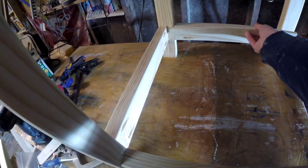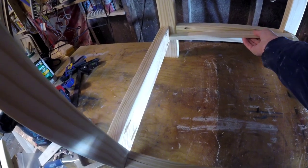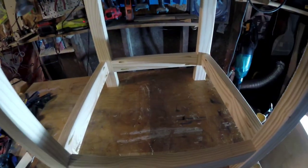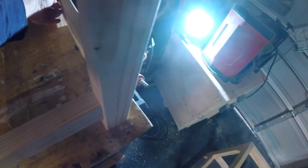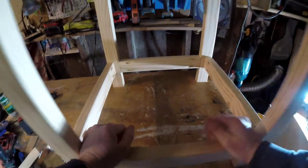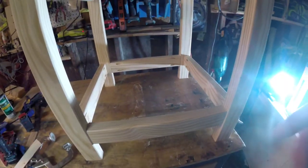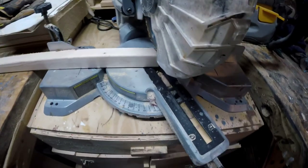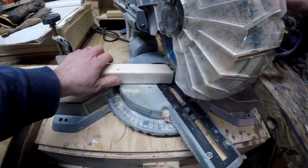I'd like to do just a little piece of one by maybe 3/4 of an inch thick, 3/4 of an inch deep, and I'll brad nail it here and use it as a platform. I'm doing two sides, but I could do all four sides too, depending on how the wood lays. But you could just do two, then you'll screw them in at the end. All right, so let's do the upside down V's now. All right, so I set my thing at 22.5 degree.